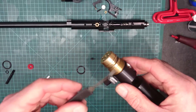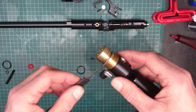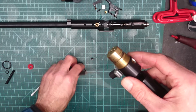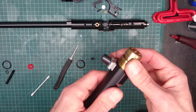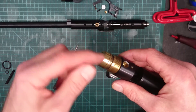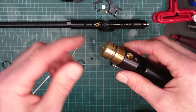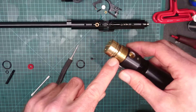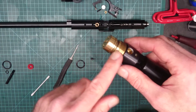And while I'm here, the other thing is, I often see situations where people have had a leak for whatever reason, and they may or may not have changed the O-ring. But then you'll find that they will decide to go and use some plumber's tape on the threads — PTFE tape. And basically, high pressure air will squeeze past PTFE, it'll squeeze past threads.